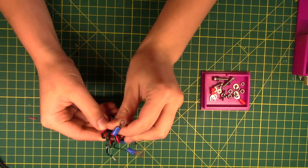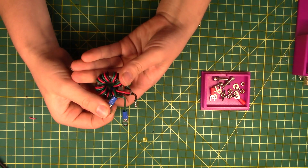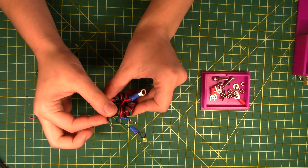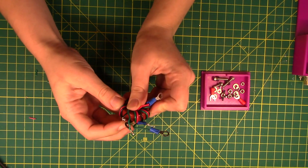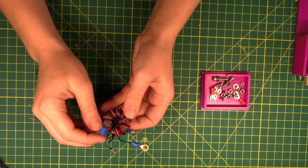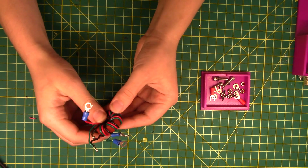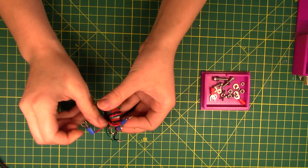This is what I've ended up with. I have my toroid with this red wire and this green wire, which kept getting shorter — so it's now inconveniently short. But I think I can still make it work. I soldered the other green wire onto it. These two are twisted together and they are going to go into the SO-239. And then this black and red one are the first pair I did, just normally soldered together. It's a bit wacky looking, I'll admit. But I think it will work. I'm crossing my fingers for it. Let's put her in and get the SO-239 soldered.